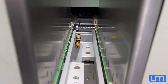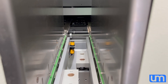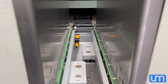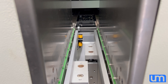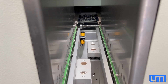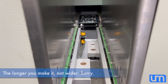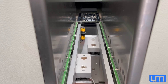That is reflowing, and there is one in here already. Squixel is not a high volume product — I'm not shipping thousands of them, or even hundreds of them. There's no need to do complex panels with more than two on a panel. By doing two this way, it means I can use the same width as 90% of my panels. The wider you make it, the more chance there are going to be paste discrepancies across the width of the stencil. So it's easier to keep it two at a time — I can just keep feeding PCBs through.